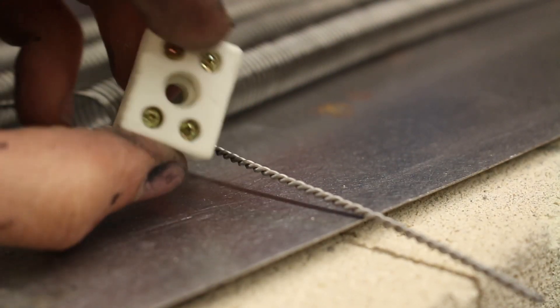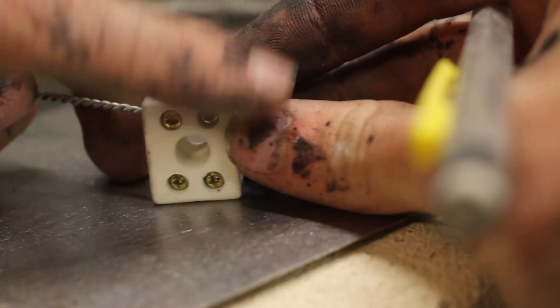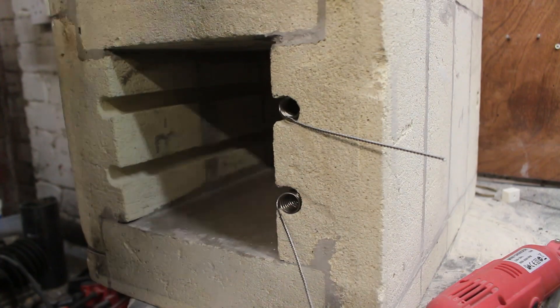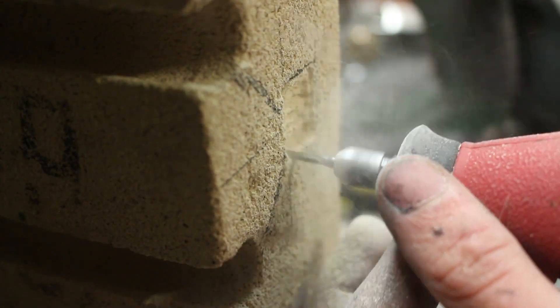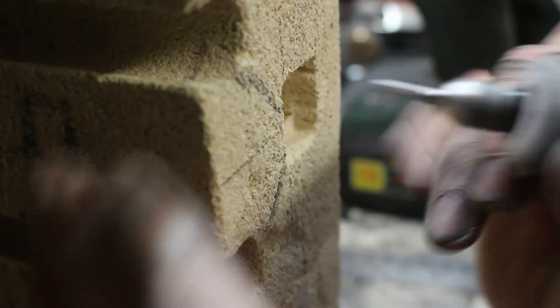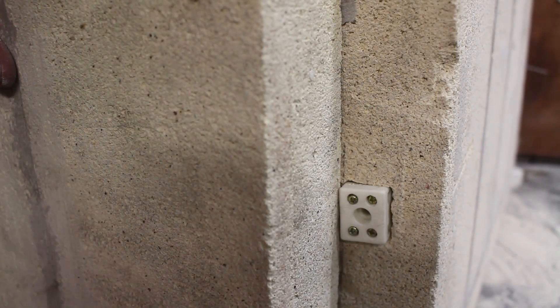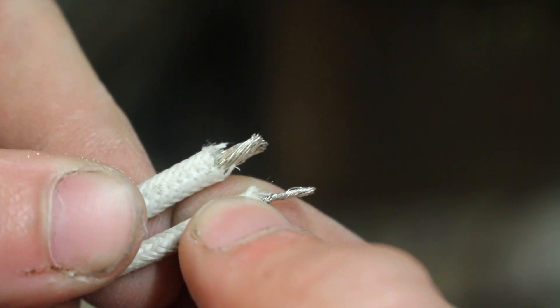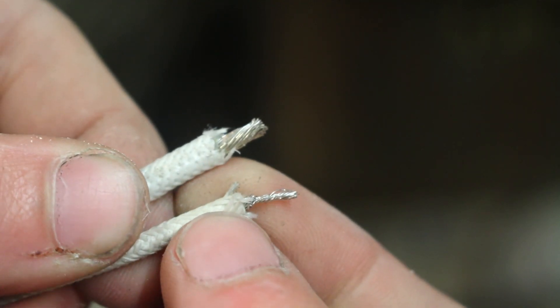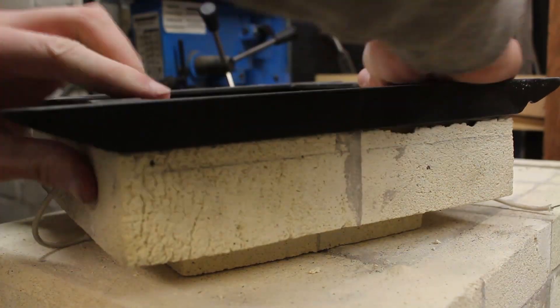I'm going to be using ceramic terminal blocks to attach the electric coils to the power lines. These are pretty high temperature — they can go to around 600 degrees Celsius — and you can buy them off eBay. They're made for using on the inside of kilns and things. At the rear of the oven you can see how the elements are going to poke out. I cut a slot in the back of the firebrick for the coils to run through and also used my Dremel to make a square indent for the ceramic terminal block to fit inside. Once cut, it was pretty fiddly but you can get the coils to fit in just like this. I'm going to be using 4mm² cross-sectional area copper wire which has got fibreglass insulation around the outside — this is high temperature wire and shouldn't melt the insulation if it gets too hot. I cut a slot around the back of the firebrick so that the wire connecting the two elements together is hidden and not hanging out.